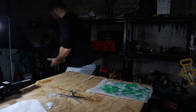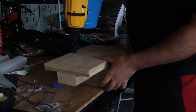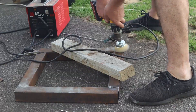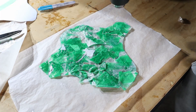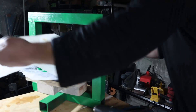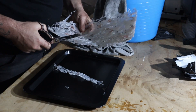It does work and you can get a good product this way, but it takes a lot of time. To get more consistency and speed things up, I built myself a press. It's way easier than you'd think — I used a car jack, knocked up some timber backing plates paired with a couple of baking trays, and welded up a simple steel frame from scrap 50×50 box section, then gave it a good paint job. With the press, the plan is to heat the sheet with a heat gun until it melts right through, then apply a lot of pressure. You can also use an oven if it gets hot enough. This consolidates all the layers, forces the air out, and melts everything together. If there are gaps, just trim the skinny edges you don't need and fill those gaps with heat and pressure. The more you repeat this process, the better the lamination and marbling effect.